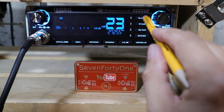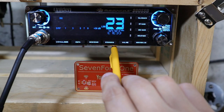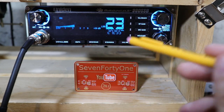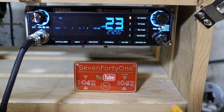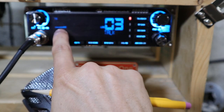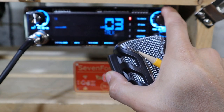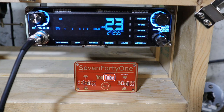The first button is the talkback control. Activating this allows the transmitted audio to feed back through the radio speaker so you can hear what you sound like. To use it you first set the talkback level: press the button so the red indicator lights, then key the radio's microphone and turn the channel selector until you get the level you want. You can see a number indicator and the meter indicator also goes up as we turn it to the right. Level zero is completely off and fifteen is the max. Once the level is set, tap the button to turn off the LED, and now whenever you transmit you'll hear your voice through the radio speaker.